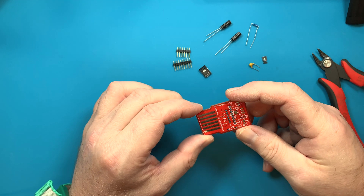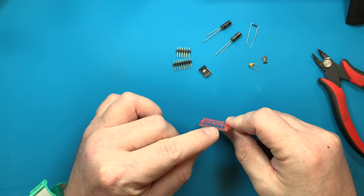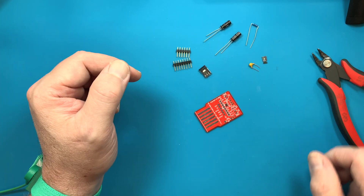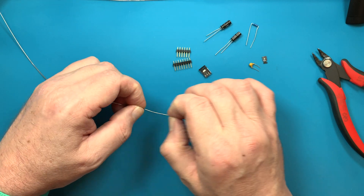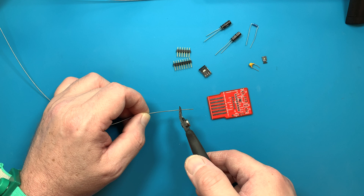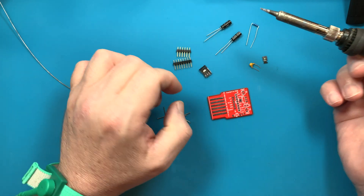The first thing we need to do is get solder on these pads — 6 on the top, 7 on the bottom — in order to thicken up the board so it fits between the row of pins on the SIO port. Looking at the instructions on the eBay sale site, they suggest a half inch of 0.8 millimeter solder melted on each of the top pads, and a quarter inch melted on each of the bottom pads. Let me cut up six of these. Let's go ahead and see how well it does — just lay them on here and melt them, try to get it to melt out evenly.